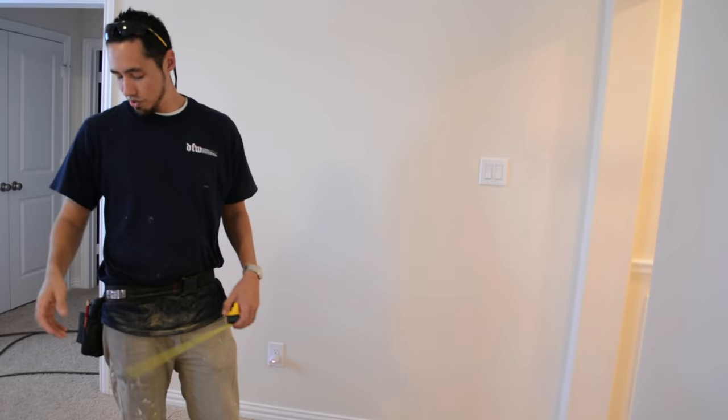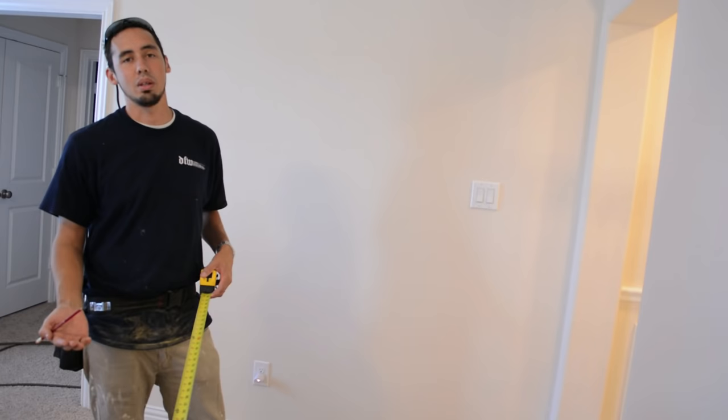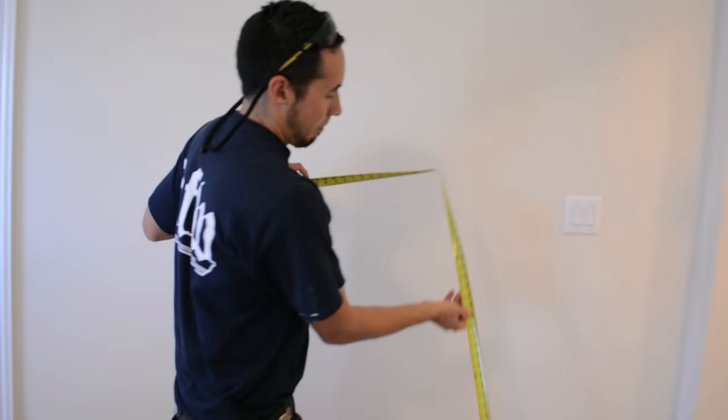Here's the wall that I'm going to be showing you how to do. As with all our other wainscoting videos, I show you how to do one wall just to give you a basic idea. The first thing I'm going to do is mark off the height of the top of the chair rail with a tape measure and a pencil. The height for mine is 40 inches — usually we're doing about 40 to 46 inches, which is pretty standard.